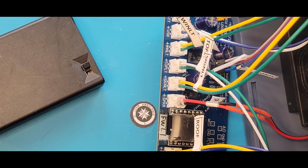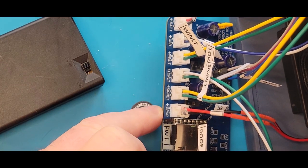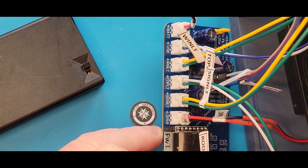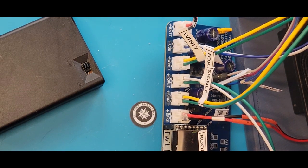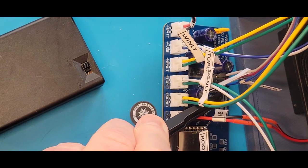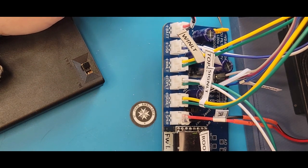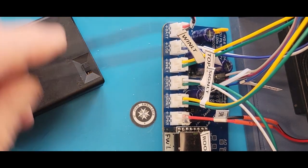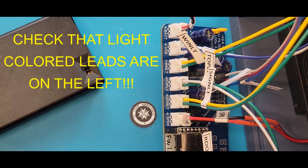So I've got it set up here for the final portion of this power testing, the hang testing. And I know it looks a little janky, but off camera, I've got everything applied to the circuit board at this point. We have the touch pin connectors plugged in the back. We've got the V-in jumper plugged in at the side here. And I've connected all the respective connectors from the project to the circuit board.